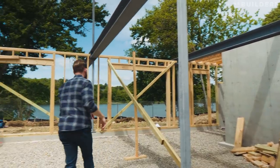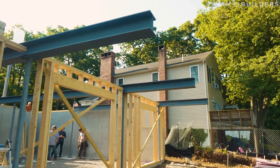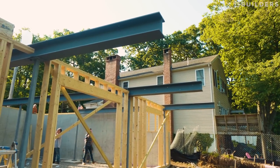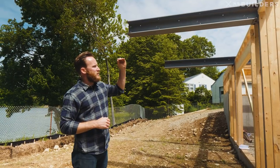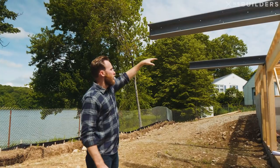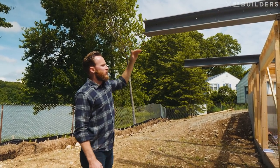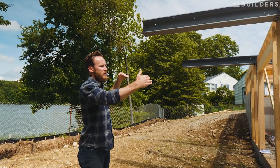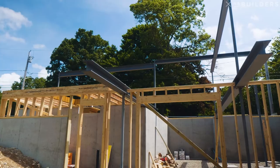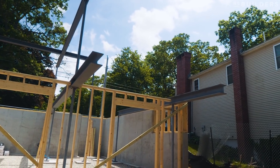Number two — let's step out here. We have this deck sitting here, and in New England, with snow buildup and things like that, we traditionally have a step outside of our entry door. What we're going to do is, on the inside of the house we'll have three-ply dimensional stock on the flat, but we're only going to have one ply on the outside. That will give us a three-inch step — inside we'll be three inches higher than the outside — giving us that small step so we can flash our door sill pan properly, bringing it down onto the deck.